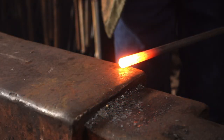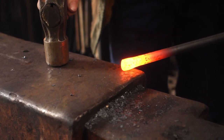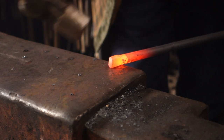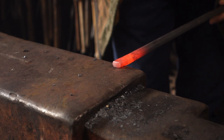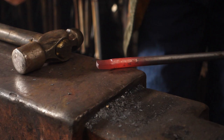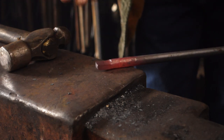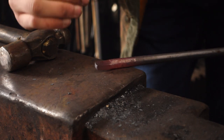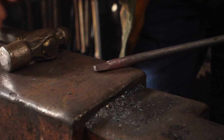We can come on the near edge and section off some material for the horns. I like quite a stubby face on these dragons — or we're going to call it a sea serpent here. So I don't want to take too much material for the horns, so I'm only taking about half an inch, which we'll then draw out when we draw down the tapers on the horns. We'll probably end up with a length of about an inch, and the face is generally about an inch long, so they'll be in proportion to each other, 50-50. I leave this to cool down and then cut the horns with an angle grinder, so that we can leave a nice clean cut. Whereas if we do it hot, we're always going to get a sloped edge, which we then need to file back. As if we were to leave a diagonal cut on the edge, we're then forging a rhombus, and steel doesn't like to be forged as a rhombus with those nasty diagonal edges.